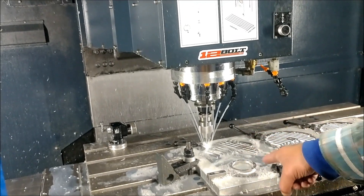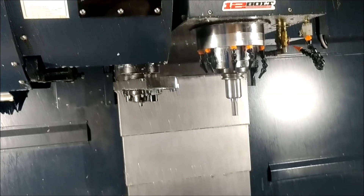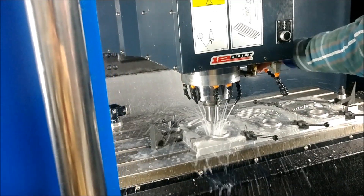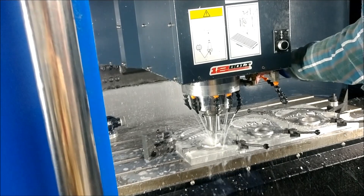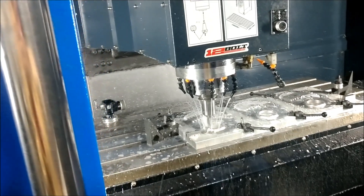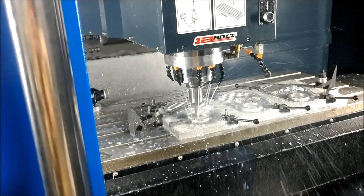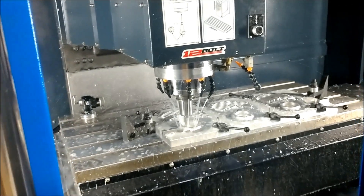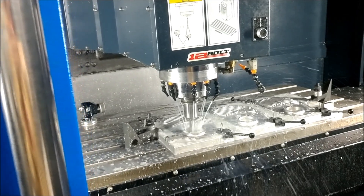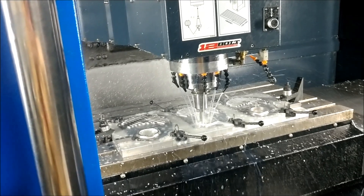After this it's going to change tools and come back and bore these holes. It doesn't take a lot of cooling. So you're probably wondering why we're cutting this hole in multiple steps — it's because you can't hold the part good enough or hard enough. So it's coming through and just gingerly boring that hole, and we hope the part doesn't come loose. That's a rough cut hole and then it will come back and do a final cut hole.